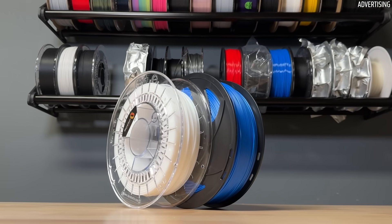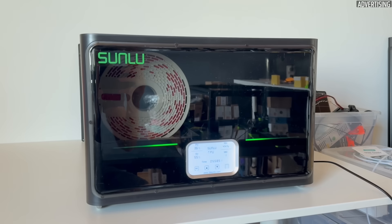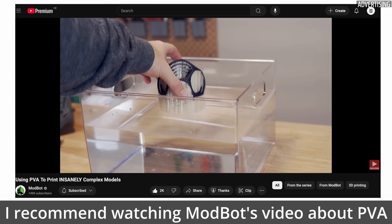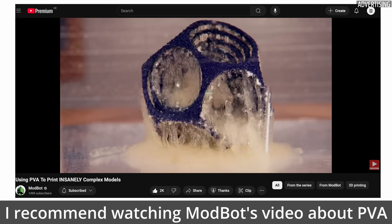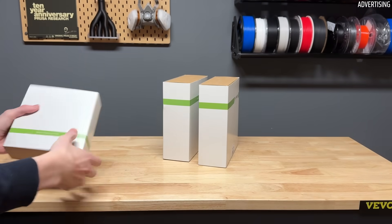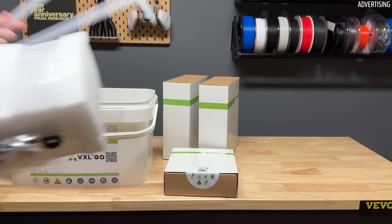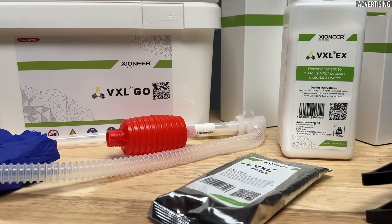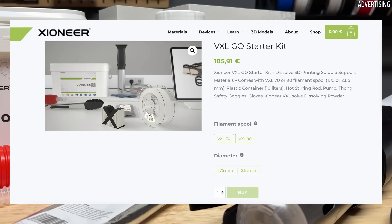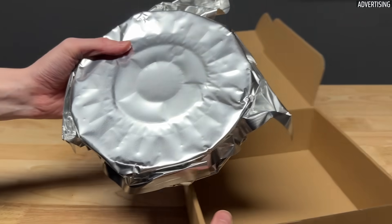Another option is filament that can be dissolved in water, such as PVA or BVOH. This is interesting because no special chemicals like limonene are needed. However, the material is highly hygroscopic and must be kept dry permanently, which can be difficult for longer prints. I then got a message from the company Xionir — they make special support materials and are probably already well known in the industrial sector. Xionir's range includes various support materials each optimized for different material types, dissolved with a special support removal agent. There is a beginner set consisting of a bucket, heating rod, and accessories for around 105 euros. Note that Xionir did not sponsor this video but sent the materials free of charge for me to test.